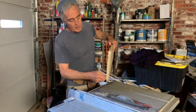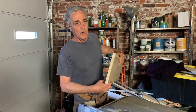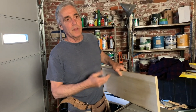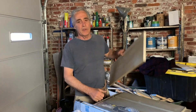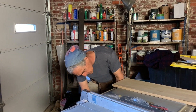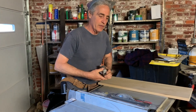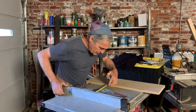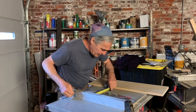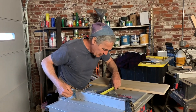On the side of the riser, I want to cut a little five-degree bevel so the front edge will sit right on the tread, and behind it will be a little void that we'll put some glue in - it'll make for a nicer, tighter fit. I'm going to set the saw to five degrees and then measure to the long point for my cut width of seven and five-sixteenths. I'll tap this over and I'm good there.